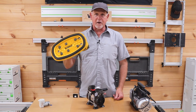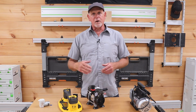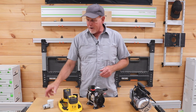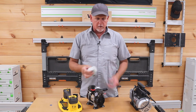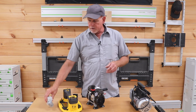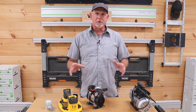This is the DeWalt version of the Grabo. We really like the Grabo for its intended purpose, but we don't recommend it for this application — that's a topic for a future video. This is an equivalent pump used to power the Grabo: a 20-liter-per-minute dry diaphragm vacuum pump with about 0.77 CFM. Do your own research, make your own decision, and make sure the Grabo will warranty that pump for this application should it eventually fail.